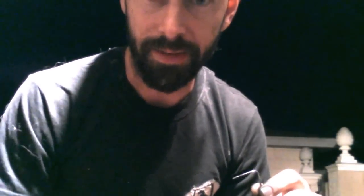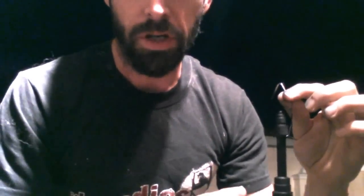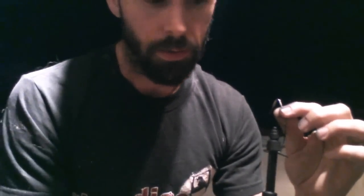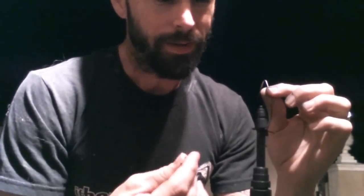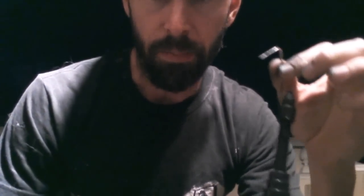There's detail underneath. Some of the pieces that had really fine knurling lines that didn't even look like they showed up in the print initially — once I did this priming step and light sanding, all those little lines became visible. It's like they printed, but there's a little layer that sticks to the surface that hides it, and once you knock it off, a lot of that detail is visible. So the light priming works best because if you saturate it too much, you lose the detail, but if you do it really light, it hardens up the surface just enough to where the sanding becomes easier. I'll let this sit, get the second coat, and I'll come back and sand it with fine sandpaper.